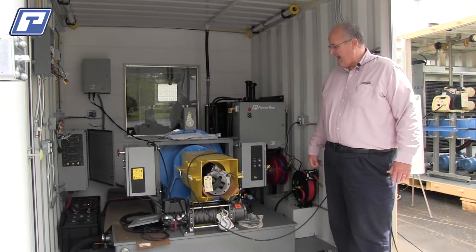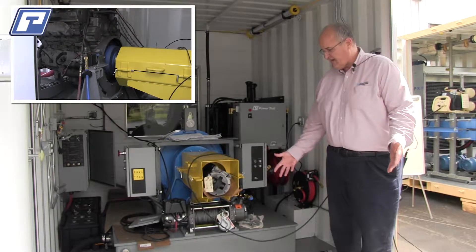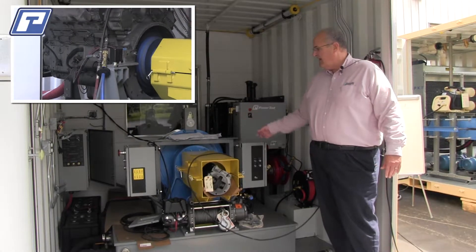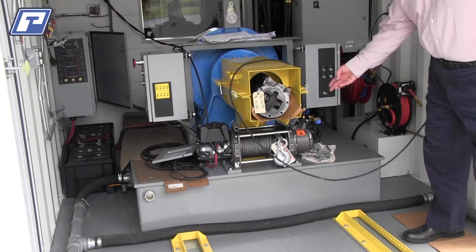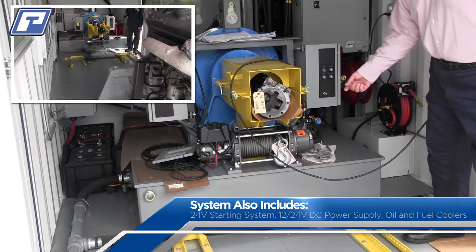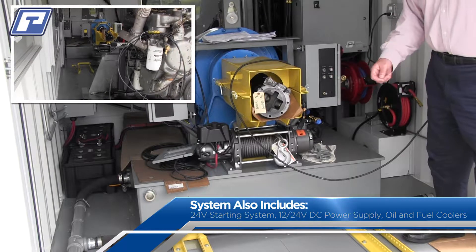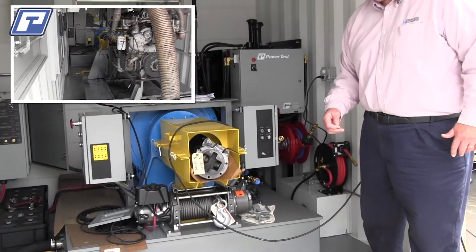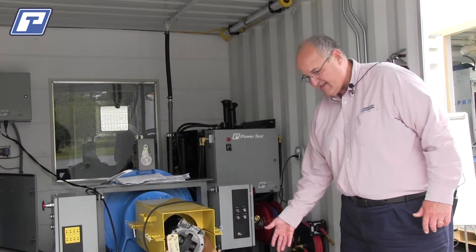Right now what you're looking at is the inside of the main container system. This is where the engine would normally be placed. You'll see the drive shaft system, the dyno, and our data acquisition system mounted on the side. Down below, mounted on the sub base of the dyno, is a winch system designed to pull the engine and engine cart into the test cell. Typically there are ramps leading into the test cell. Once the cable is connected to the engine and engine cart, it can be pulled in and locked into place on the retainers at the bottom.